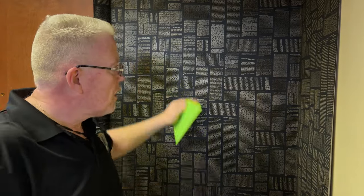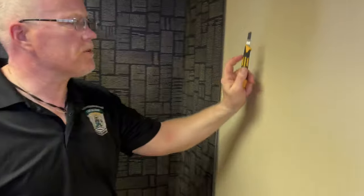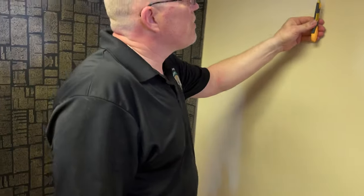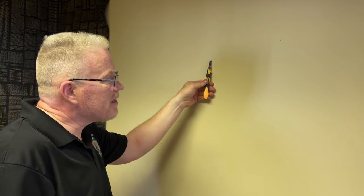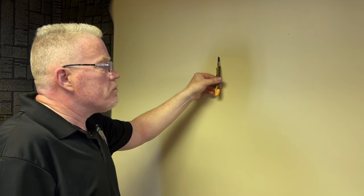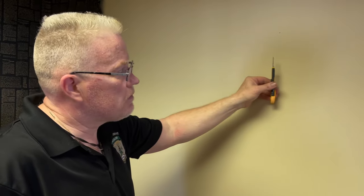Number one, the seams. If you don't cut your seams on a right angle with the wall on which the paper is hanging, you're going to get angular slicing. If you could just come behind me, I'm going to show something to the people. So if you take a look at the angle of my blade, it's square with the wall, meaning it's 90 degrees. It's not like this, it's not like that. I'm exaggerating an error that's commonly made with commercial vinyl, and you'll see it on black wallpaper.